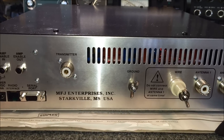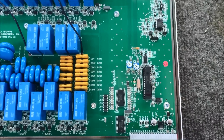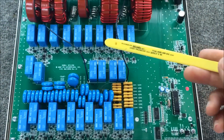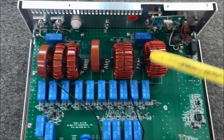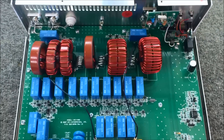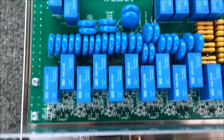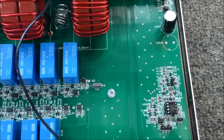A quick look inside: you'll see a lot of surface-mount components, little integrated circuits, and a row of relays — a lot more relays up here too. You have your capacitors, inductors, and toroids. Between all three of these is how it makes its match for each band, for each value of SWR at the frequency you're working on — using a combination of relays, capacitors, and inductors to make the match. That's 134,000 possibilities with all these components inside. Not many serviceable parts, so if you have a problem it's not user serviceable, but very intricate nonetheless.